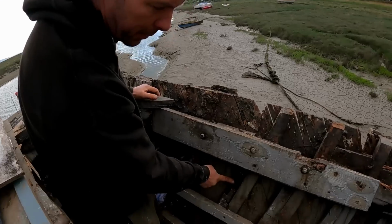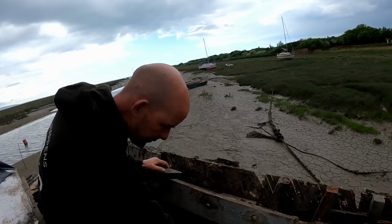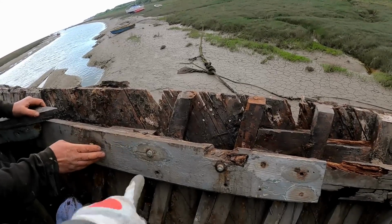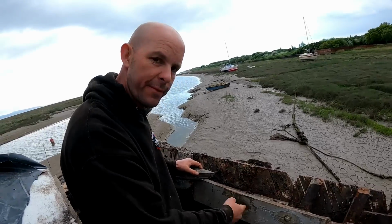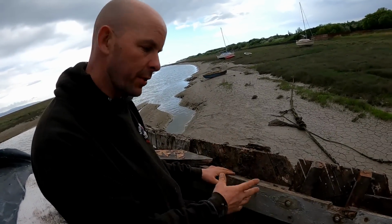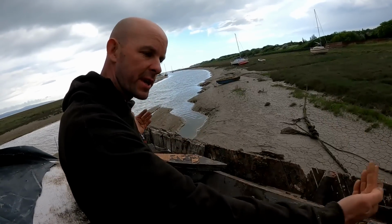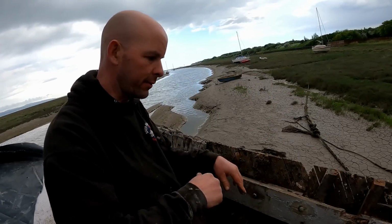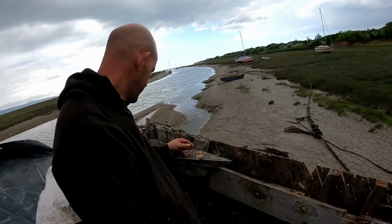So we knew that this frame was poorly, it's had a repair at some point, but we will replace these frames. That's an easy job. So the original frames haven't got any tops. And they're just the sisters that we spoke about that were short down. So I think we'll do a nice repair on that, because we're not going to get many chances of that, are we? And then once we've done that, we'll start doing the beam shelf. I'm not too sure whether to do a very short section of the beam shelf first, just to get all this pointy end done, and then we've got a free run down both sides, haven't we? Rather than trying to do all that.